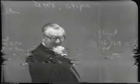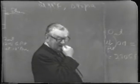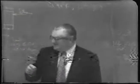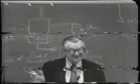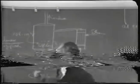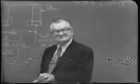In this operation, you have the steam and the water that's taken off the product going out the top there. Do you have to have some feedback out the bottom for the concentrate into the tank? Or is this just, I didn't draw the condenser and the barometric leg and the water circulation system, the condensing part. This vapor goes to the condenser.